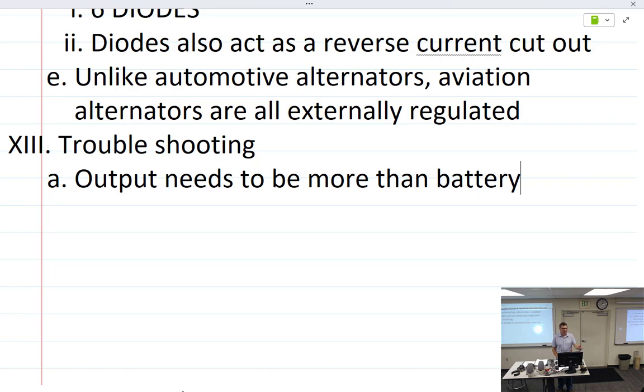Not good. Hey, it says voltage regulator. So what did I have to begin with? 11 volts. What am I measuring? Your battery. Battery, and then I started it up and went to 12.5. Alternator's working, right? Because it went higher. As soon as I started turning it, it went higher. So that means it's working. But is it working the way I want it? No, its voltage is too low. So what's the problem usually? Voltage regulator. Bump the voltage regulator up. All right, so not hard.